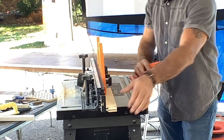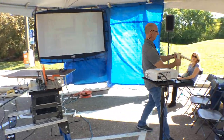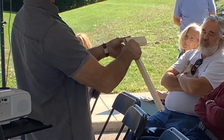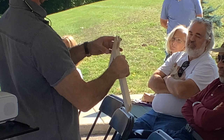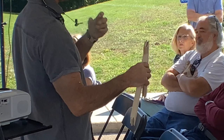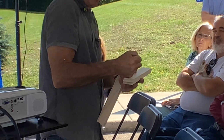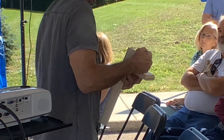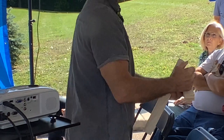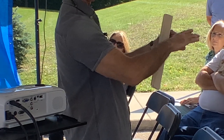And then the test is, put them together, and are we flush here? So part of this answer is, are we flush or really, really close? What I've seen from doing a lot of cabinet doors in classes is, when you do this cut, especially if you're doing a lot of doors, this is subject to how hard am I holding down on the router table as I poke that in. And on the first five, you might be like, yeah, yeah. And by the second 20, that can slightly change this elevation here.